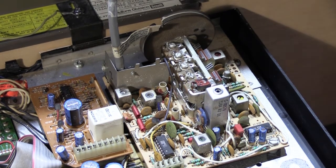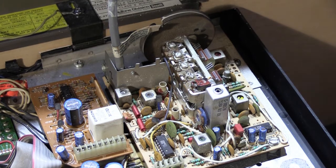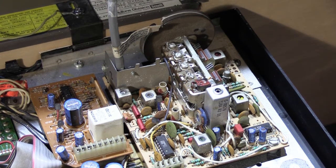All right, so now on to the heart of the matter. So everybody who's watching this video, raise your hand if you had a CB radio in the 70s and the 80s. So all of you who had CB radios, remember that there was always an adjustment on your CB radio. It was the Squelch Adjustment. And the Squelch Adjustment adjusts the sensitivity of the receiver to block out the static sound that you get in between channels, or in the case of a tuner, in between stations, and it also blocks out weak stations that you really can't receive. Otherwise, as you scroll up and down the tuning dial, you get all of this static and you get these stations that are far away and really weak, and you really can't receive them properly.